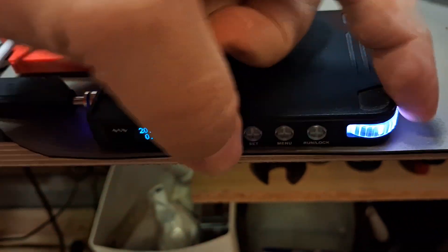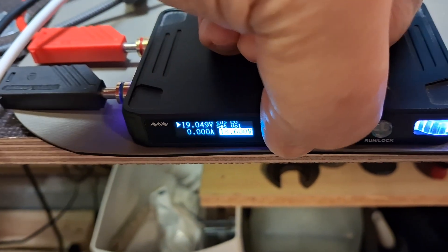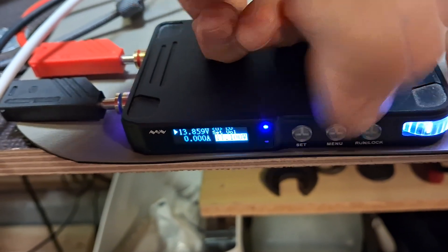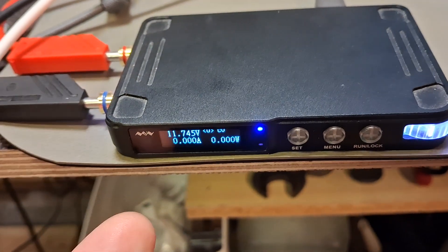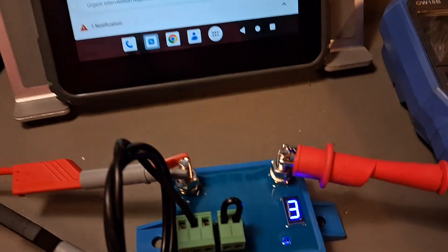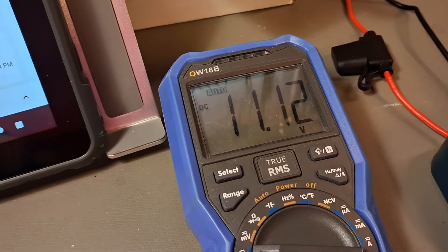The load is connected and now we're going below 15 volts. I set 11.1 volts — and you can see the load is not disconnected yet. No alarms yet. Now we get the alarm, and the voltage warning. The load is still not disconnected.